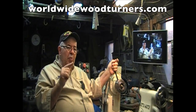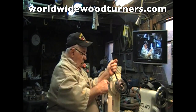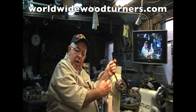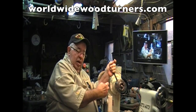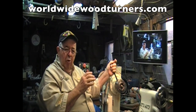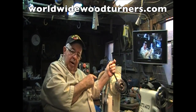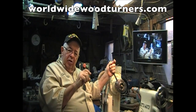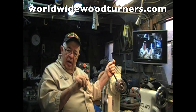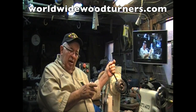A little bit of problem. Just a little. The energy to squeeze the jaws was compacting on that Morse taper, right? And you had hardened jaws against a hardened other. So you're going to get minimum slip, but when you do, it's going to be a biting slip. Number two, it's a Morse taper. At what point on a taper do you think you have a good uniform setting? It ain't. Your taper doesn't match their taper. Their taper doesn't match your taper. Not a brilliant idea.